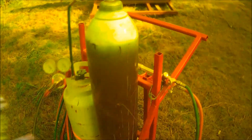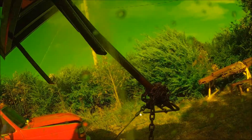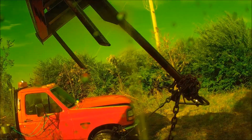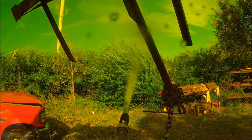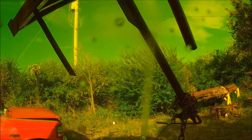Just need a tad more. I'm going to cool that down a little bit more because we want to be a little gentler next time. It might even be enough that just the weight of the chain might pull it down just a little bit. But this won't work without some force — you have to either have weight or a restraining force on that steel.